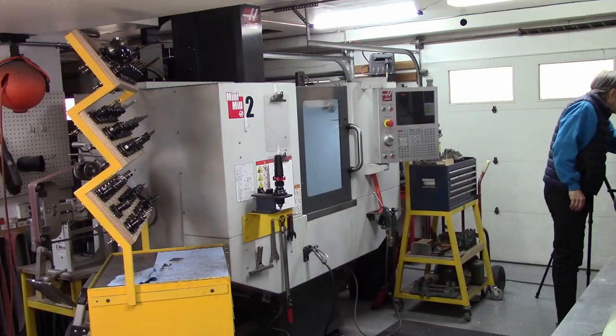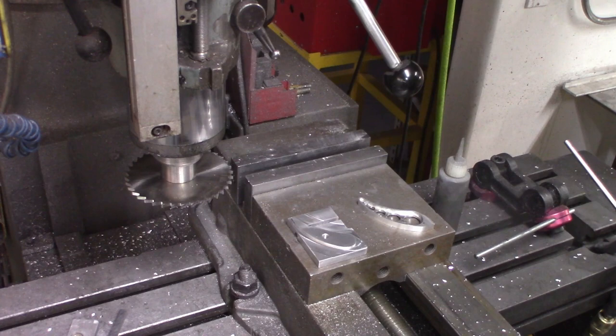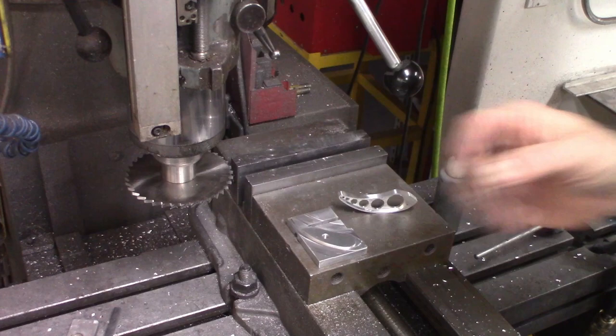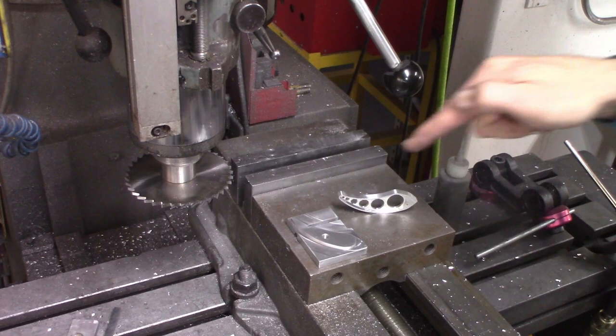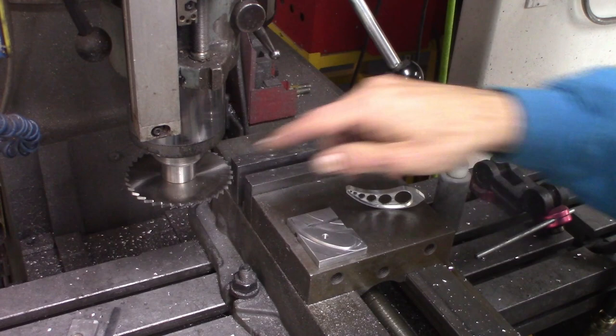Because of the way that I'm going to be mounting the glass hexagon, I need to cut a little slot in the side of the part right here. I looked at doing it with an 1/8 inch milling cutter, but because of the geometries involved, I didn't quite have a tool holder that could make it into the area without interference. So I'm going to be using the tools I have, which is an 1/8 inch slitting saw.